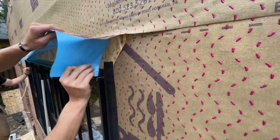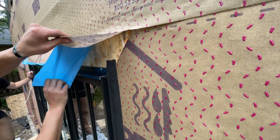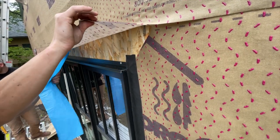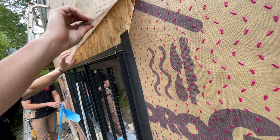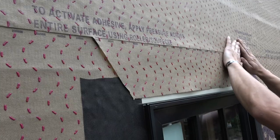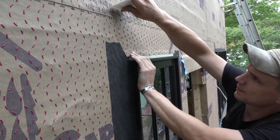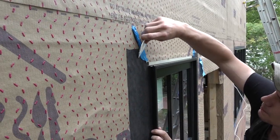At the head, they removed the backing paper from the sticky house wrap — that's a pretty sticky acrylic adhesive backing. They stick the Hydrogap SA over the head flashing. Steven seals the angle cuts with a few dabs of liquid applied flashing and squeegees it smooth.